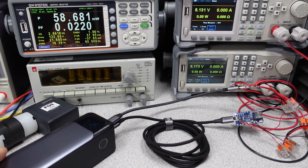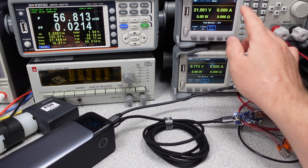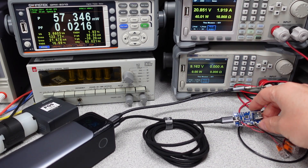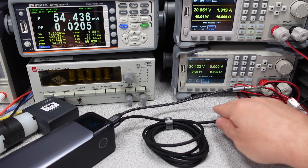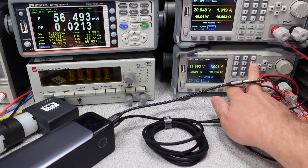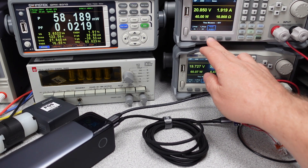That number will be worse with less efficient power adapters. This is not the worst if you need portable power, but if everyone used a power bank like this, you'd need 24% more grid capacity for no benefit. I wish they would put these specifications on the product listing or web page, since it's all a guess when you buy. In this case it wouldn't really help them though, since it's massively inefficient or the capacity is inflated greatly. Companies need to be honest and state the watt hour capacity for any battery product — this is a crucial number that tells you what you actually have for capacity.